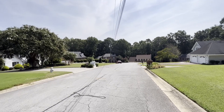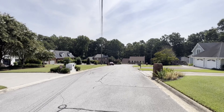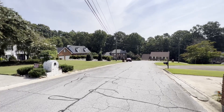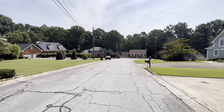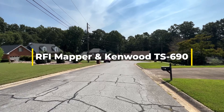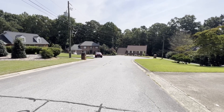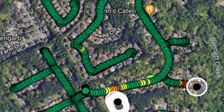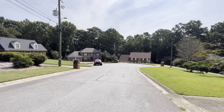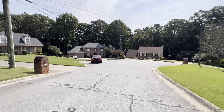You guys know from my channel that for the last two years I've been fighting this RFI, and the power company has been difficult to get out here. When they did come out, it didn't really fix anything. Jeff took 1700 data points with RFI Mapper — we drove around the entire neighborhood, every cul-de-sac and even the next neighborhoods over. It's software receiving from his HF rig using a Kenwood 690, and it actually vocalizes the decibel level of the noise every time it takes a data point. So we have 1700 data points literally on a map of the area, and now he's pinpointed it down to exactly which hardware.